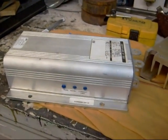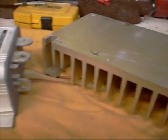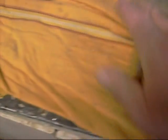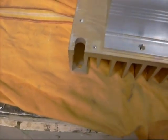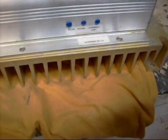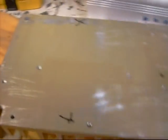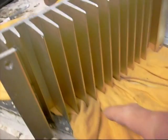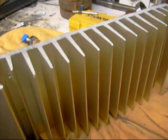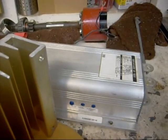Now this motor controller gets pretty warm, and so what we have here is a thing called a heat sink. You can see it's got lots of fins in it, and that is to carry away the heat from the motor controller. The way it works is you put this stuff called heat sink paste on the top surface of that heat sink, then you put your controller on there. When this heats up the heat sink paste will transfer the heat into the heat sink and that heat will escape from the fins. This is usually mounted on a wall, vertically, so that air comes in the bottom, gets heated up by the fins and then continues out the top by convection. So that should keep the controller somewhat cool.